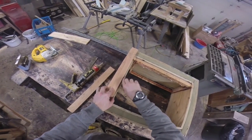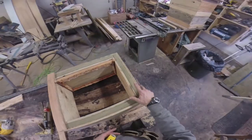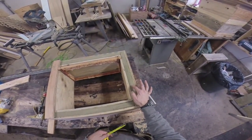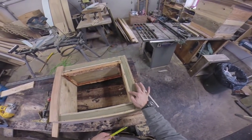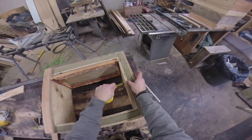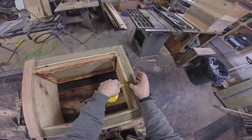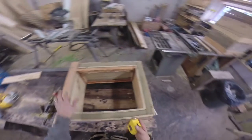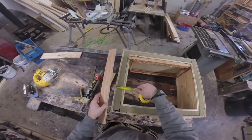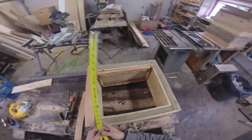The covering piece needs to allow for a little bit of a gap for the frame to sit inside. If you've used the one and a half inch Rock Saw, you've got half inch plus one and a half plus another half — that's two and a half total wall thickness. With that two and a half, you want to take off 3/8 of an inch to allow for your frame to sit in here. That means on your half inch piece of plywood you're going to have a 1/8 inch overhang. So with two and a half minus 3/8, this piece becomes two and 1/8. My length is nineteen and three quarters — that's what it should be.